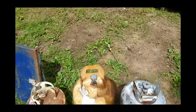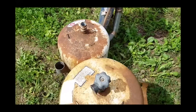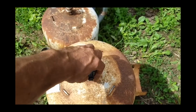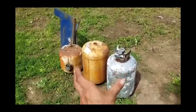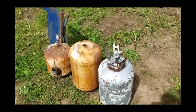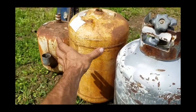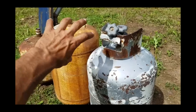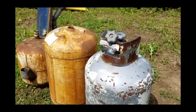The first part is removing the handles on top — I've already cut them off of two of them. The next part is to unthread your valve. Now if you've never taken apart or cut into a propane tank, I actually don't suggest that you ever do it. We're going to take the two big tanks, put those together and make a nice tall tank out of it. We'll cut them here, flip one tank over on the cut, weld that back together, then cut our feed opening on one side and our opening into the reduction zone and burn chamber on the other.